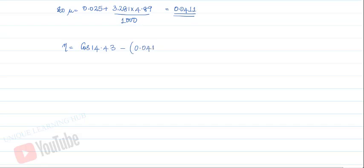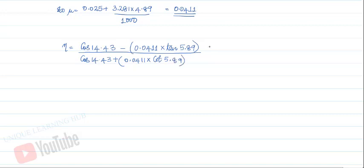The efficiency is η ≈ 0.7054, which is 70.54%. Next, heat generation and heat dissipation are calculated. Heat generated qg = μ × fn × vr / cos γ, from equation 12.63a, page 227. fn = Ft / (cos γ × cos α) = 34.61×10³ / (cos 5.89° × cos 14.5°) ≈ 35.9 kN, and qg ≈ 7.26 kW.